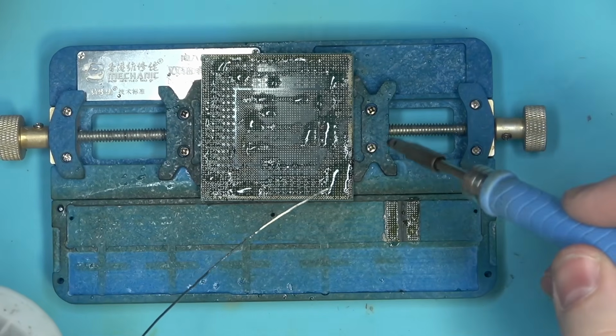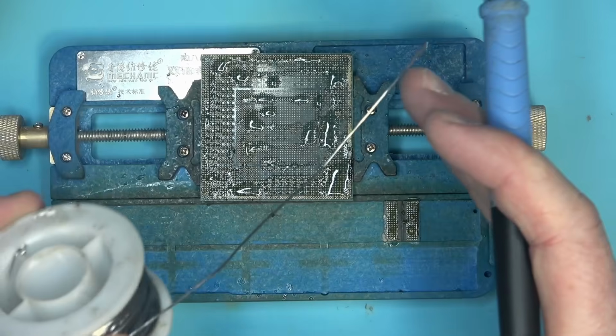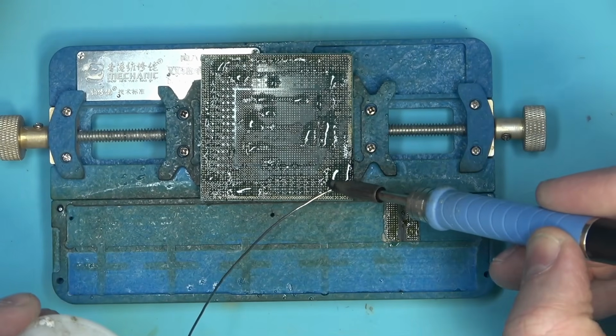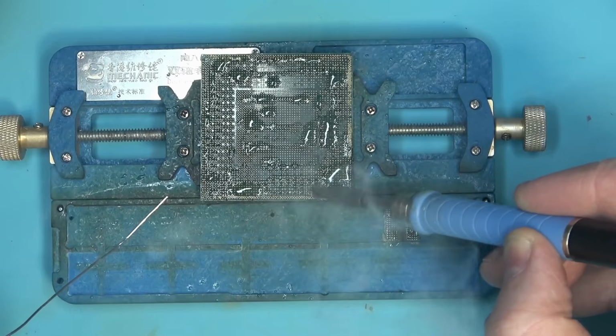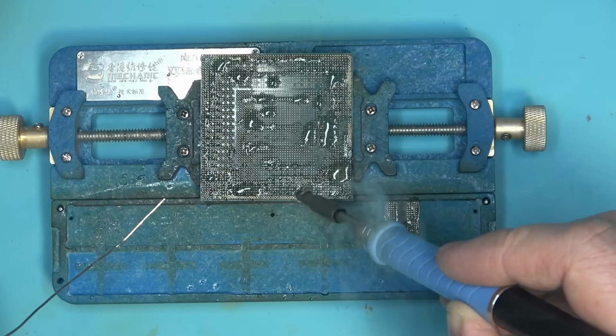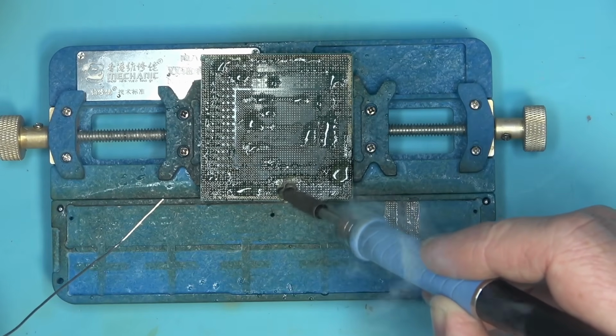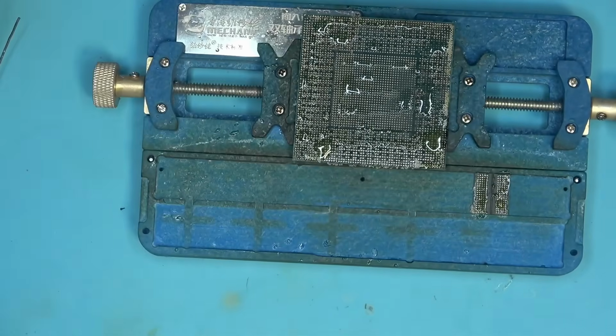With the exception of that boiling action. You want the flux to be in one place, but it boils and starts to expand, and it just goes everywhere you didn't intend it to when you apply it on the hot board. But if you start on a cool board, it's not going to help you because it won't flow anywhere. No idea why it does that.